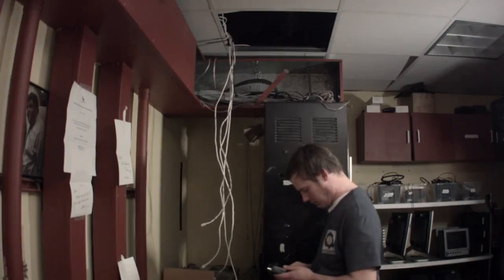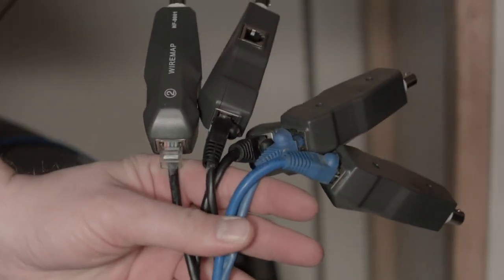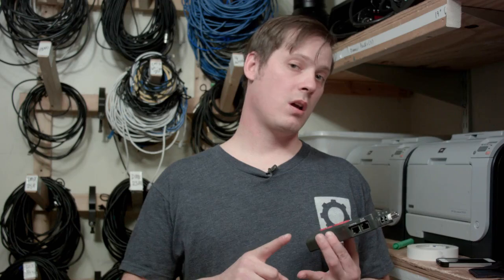How about the mapping feature? Let's say hypothetically you have a wad of wires in one room going to up to eight different rooms — the ballroom, the conservatory, the billiard room, and the lounge. Since the kit comes with eight numbered remotes, you can map, identify, and test up to eight cables — coax, RJ11, or RJ45 like Cat5 and Cat6.